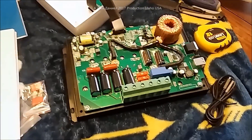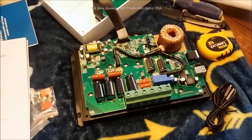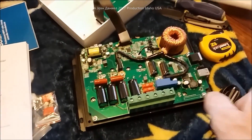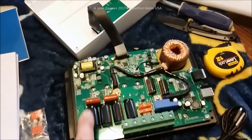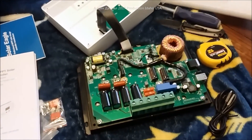So far they look really good. This is a real MPPT — not one of the fake ones. Be careful, because they're putting MPPT on everything that's either PWM, click-switch, or whatever. Only get one that has a real toroid, true MOSFETs, and heavy capacitors — otherwise it's fake.